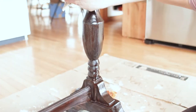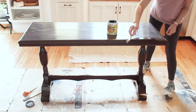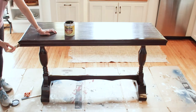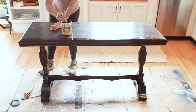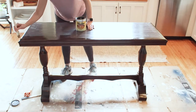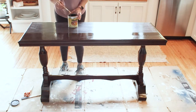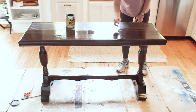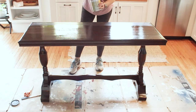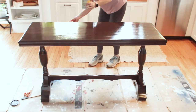The next step is to apply two coats of shellac. Shellac is an all-natural, non-toxic clear coat that will seal the furniture. The first coat seals it all in; wait an hour, paint the second coat for the final seal, then let it dry overnight before applying paint. Shellac can be cleaned up with ammonia and water, but be careful not to splash it in your eyes. I typically use a chip brush and throw it away when done. Between coats, I put the chip brush in a zip-lock bag. Chip brushes are inexpensive — about 50 cents each.